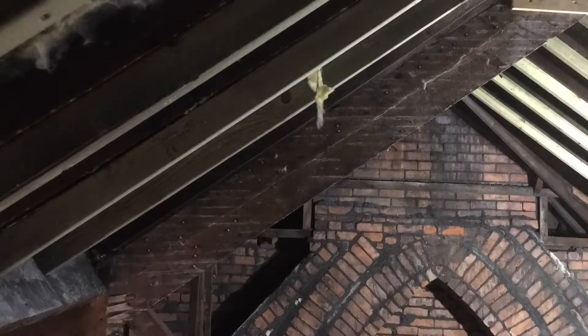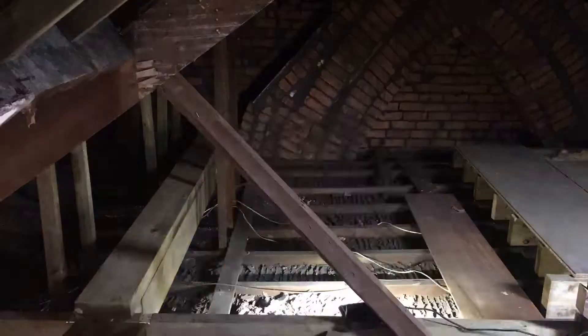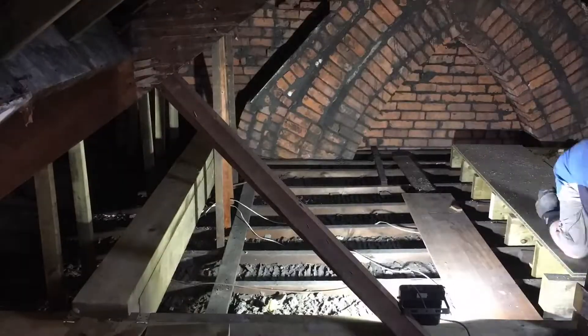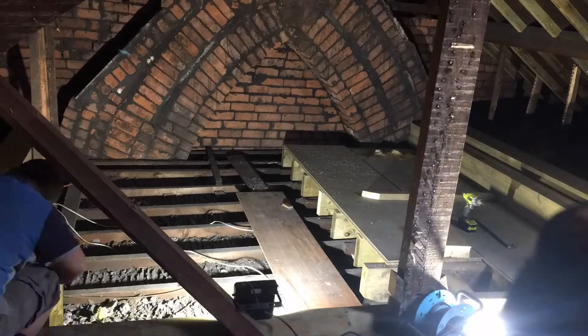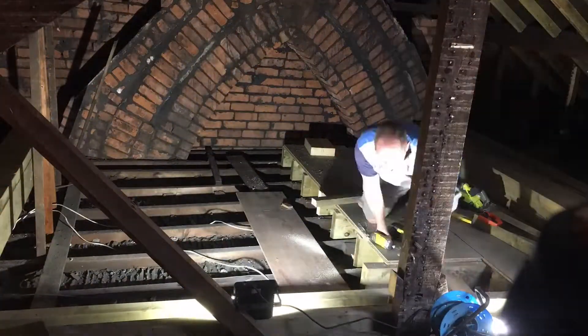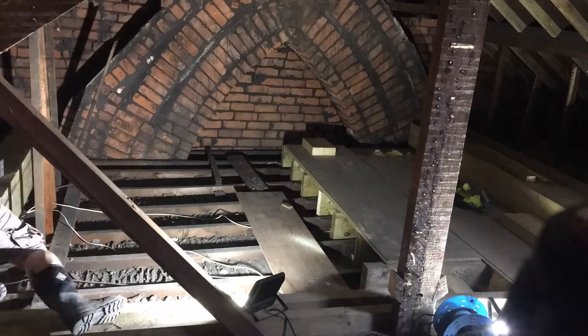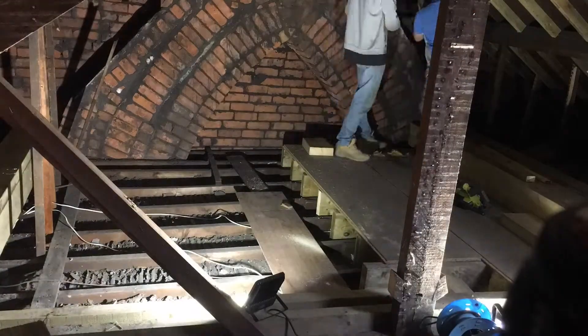You'll see me disappearing in and out of shot as I'm putting a structural beam in from that brickwork across — because we've got a structural wall that forms the side of our stairwell. So there's a beam going in sideways, which I'll then use to hang beams across to that central wall plate. There's that great big beam — it's an absolute monster. I'm walking on a bit of old wardrobe from the side walls because it's a lot safer.